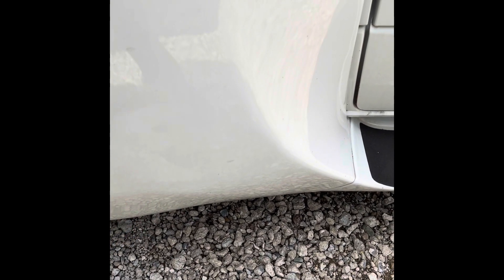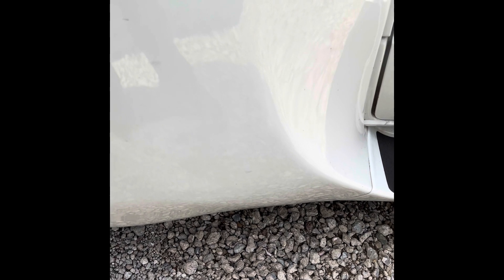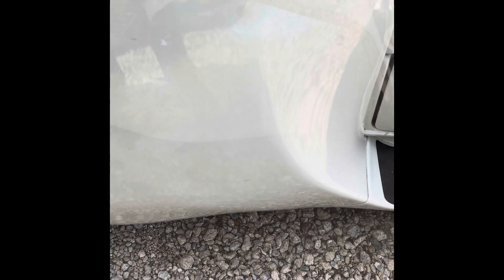I'm talking about the angled part of the RV — it's going to be right here, right beside the passenger door. The wires will start up, come in, then drop straight down. Now I'll have to go underneath the RV and remove a panel that's down underneath there, so the wires will come out from the bottom. Here we are underneath, and this is the panel I'm talking about right here. It's got six screws holding it in place — this is the bottom of that angled area. Removing this will allow me to bring the wires down and out, back in this corner where the other wires are coming out.